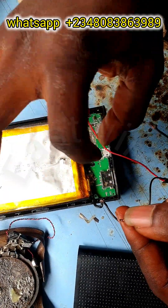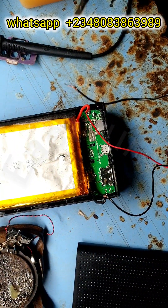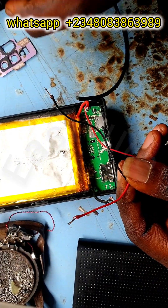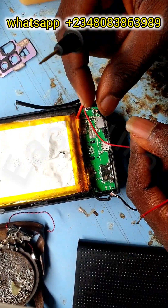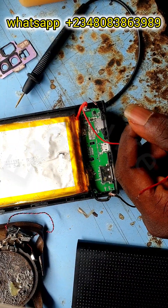Please don't let the cables bridge together — it could explode the battery. Please be very careful of that; you're going to hear a boom. Please don't let that happen. It's a time bomb, so please be very careful.